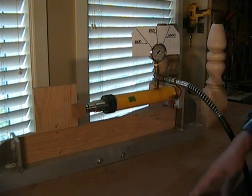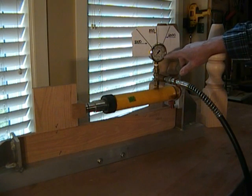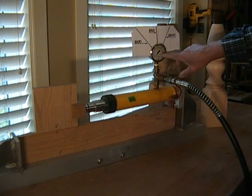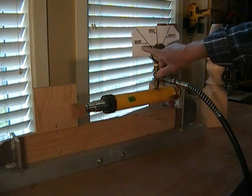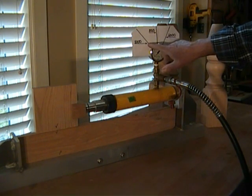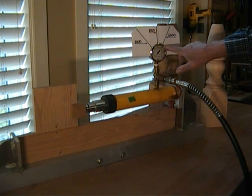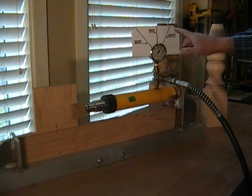To do this test, I found that this gauge goes up to 3,000 pounds per square inch, but it's not really readily visible, so what I've done is extended the divisions out. This line here represents 1,000 pounds per square inch, this one represents 1,500 pounds per square inch, and this one represents 2,000 pounds per square inch — remember that's close to a ton in load.